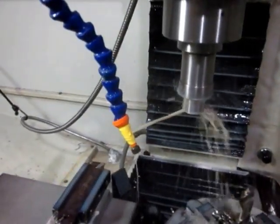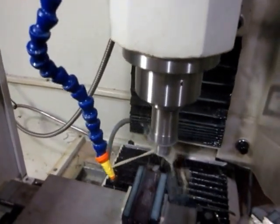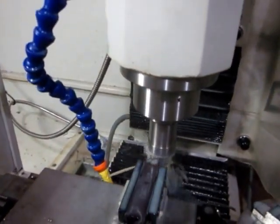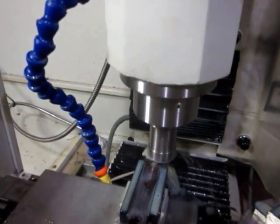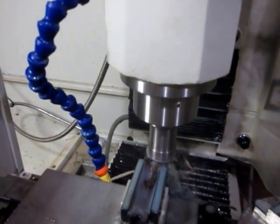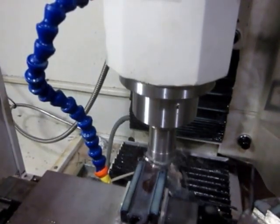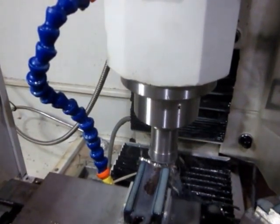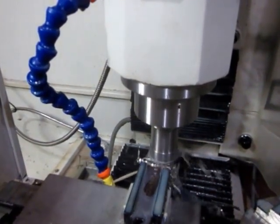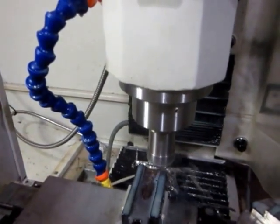The cutoff tool is going to come over and cut the part off and create a 45 degree chamfer. I go in as deep as the chamfer and then come back and create the chamfer with the cut off tool. There's a little chip wrap there sometimes, but it hasn't really been a problem when it comes to pushing the tool around or damaging my finish.